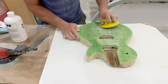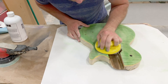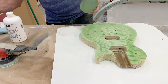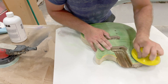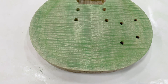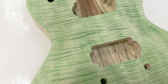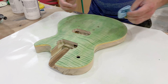I'm going to sand it back a little bit to do a grain accenting technique. The gist of it is pretty simple — you sand back partially and then the dye stays in the open grain and kind of comes out of the tighter closed grain because it hasn't soaked in as far. So I'm using a high grit piece of Mirka Abranet here. And this is what I'm left with afterward — I've accented that deeper grain in green. Things are looking a lot smoother, more even, no pigtail sanding marks. The areas that are dyed — that's the natural kind of look of the wood.